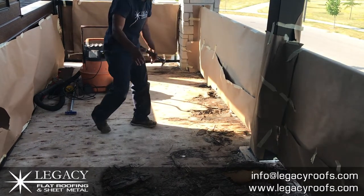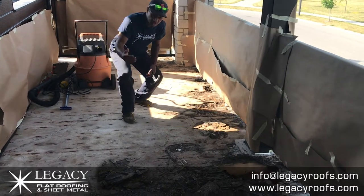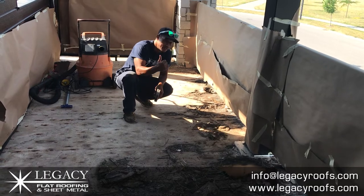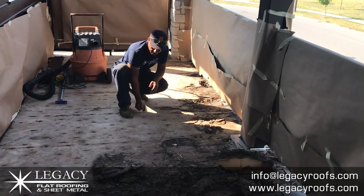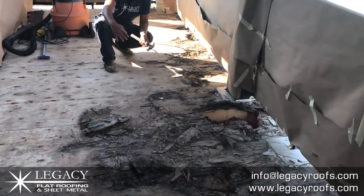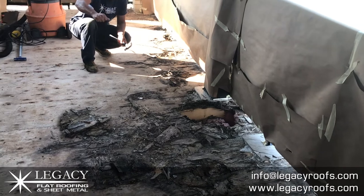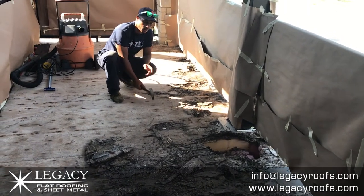We have the existing three-quarter inch flat deck. We have to rip that off and make sure it's tapered nicely, because when we put the new Duradex, we want water to drain to the outside — we don't want it coming back to the house. We have to rip all this, make sure the floor joists are in good condition, and if they're not, we sister more in and make sure it's nice and solid.